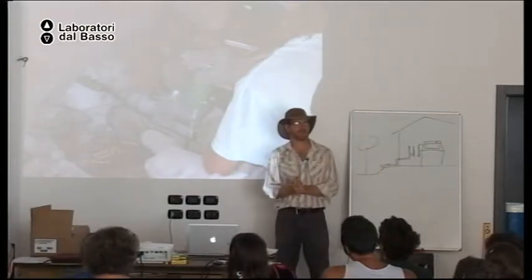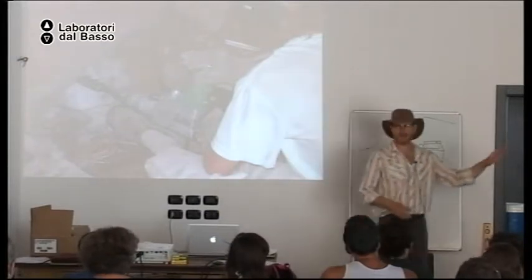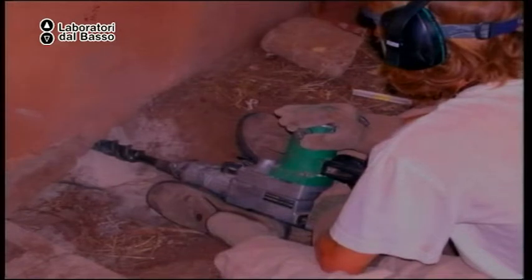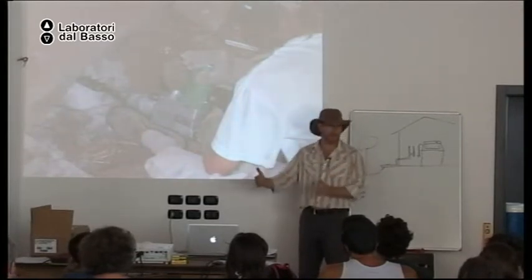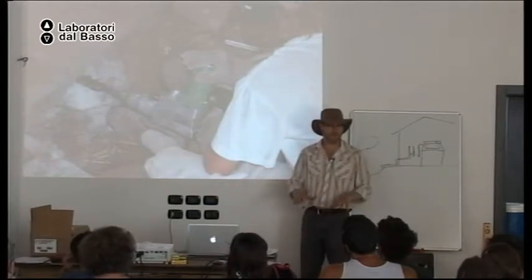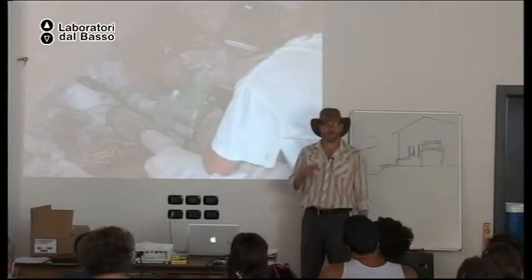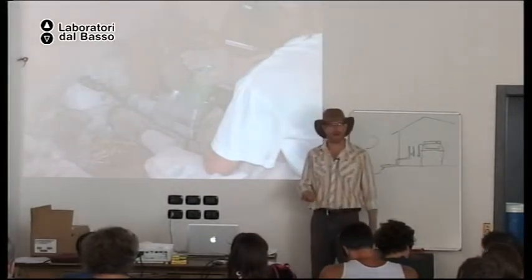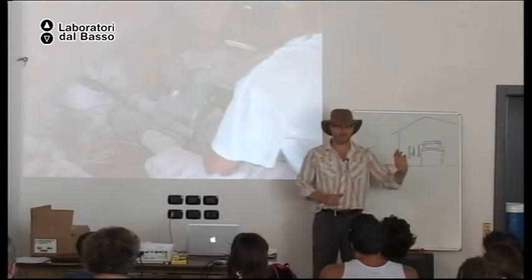The main thing is, if you are wondering what is accessible in terms of gray water, if you have a sink, a washing machine, or a shower that is against an exterior wall, then in my opinion, you can probably access that gray water. But if the washing machine or bathtub is in the middle of the house, and you have concrete or stone floors, it's probably not accessible. It's too much drilling and jackhammering. So if you are designing a new home or retrofitting an existing home, try to always put your gray water sources against an exterior wall for easy access, okay?